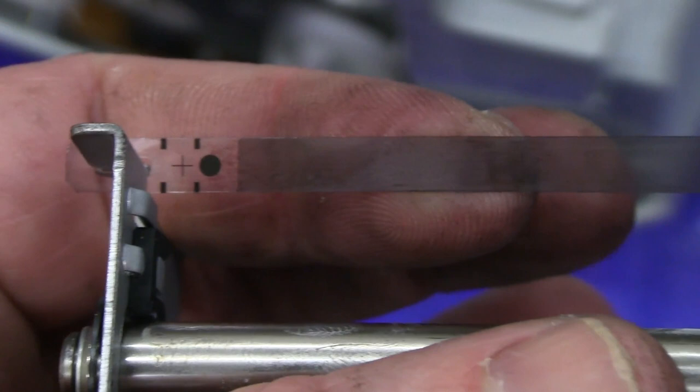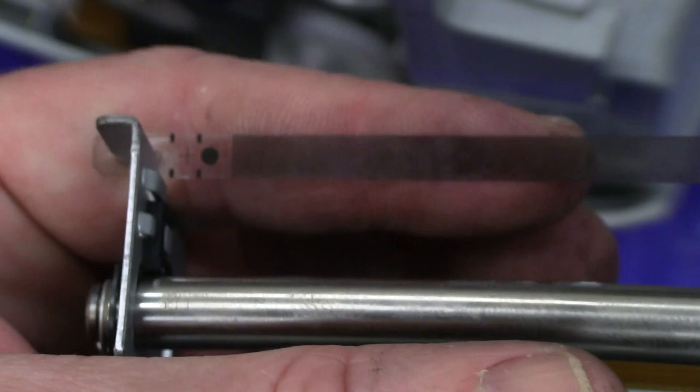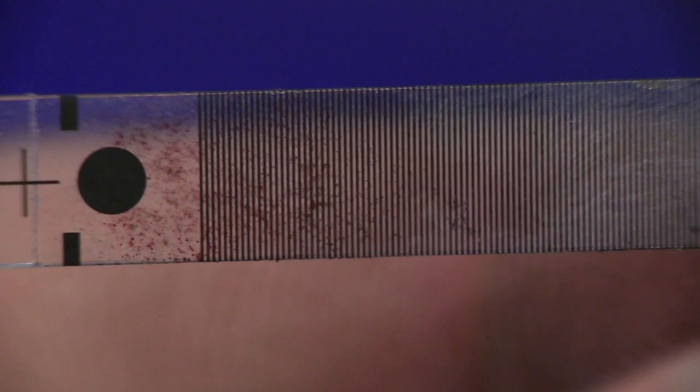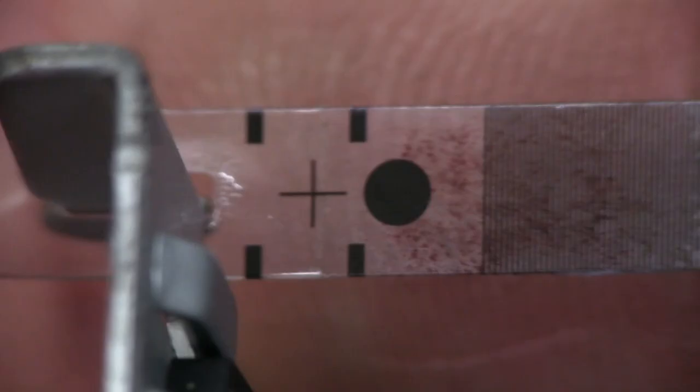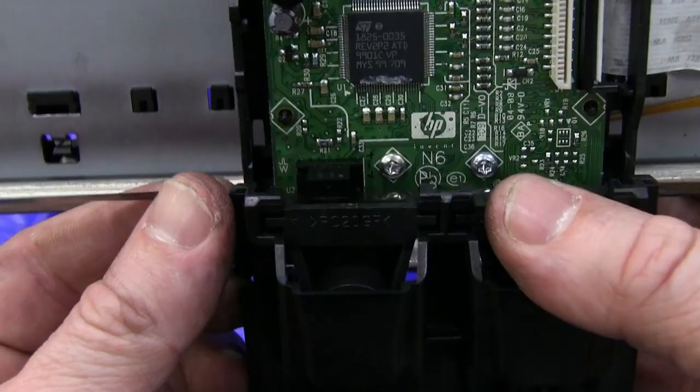You can see they've got a tiny little stripe pattern there of a known distance. You'd have to know what the distance is, of course. But even if you didn't know, you could actually calibrate the thing based on that number of counts. It'd be a photo sensor in the head down in here — that tape runs through and you can get a pulse count out of it. No doubt. That could be very, very useful. It's absolute position relative to the mechanical frame, not going to be very good of course, but you could certainly use it as a relative position. It's probably as fine as you would want for positional feedback.